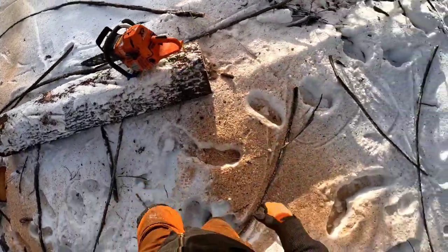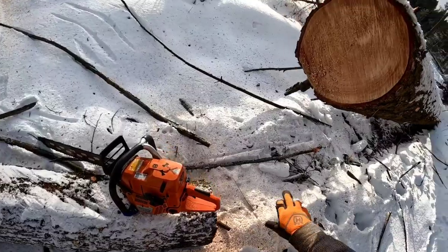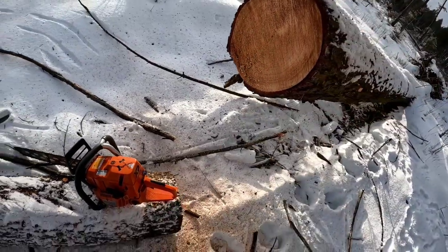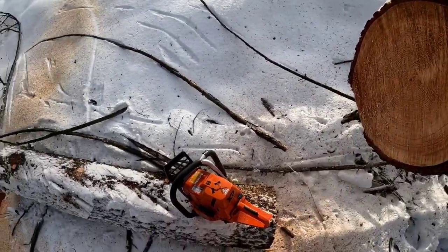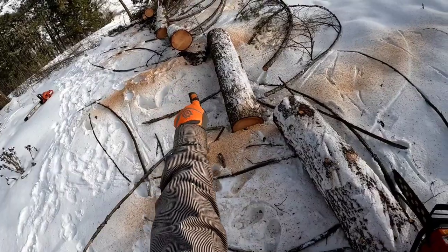With a sharp saw, you can get away with it in the right wood. We got lucky on that one, but see, it still broke wood right there, a little tiny bit. Had I come up from the bottom and then looped around, come down from the top, it wouldn't have done that, right? As you can see, those over there, flat cuts.